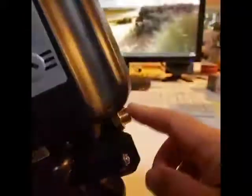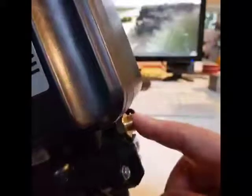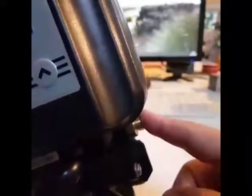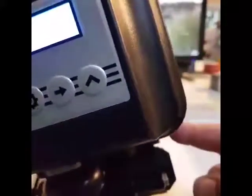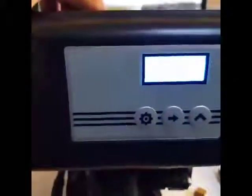At this point you should be getting a vacuum here when you put your finger over it — it should be quite a good strong suction. If it's not sucking, or even worse it's actually filling out of this orifice with water coming out of it, that's a sure sign that you've got an injector problem. So now I'll show you how to fix an injector fault.